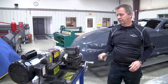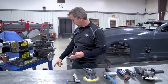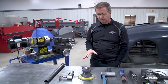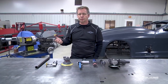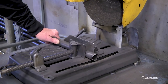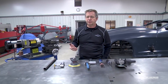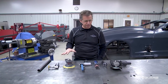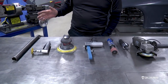There are lots of other ways to fit tubing also. This is a really nice machine with a nice little table where you put all the cutters on the bottom, but there are some other pieces you can use. To cut the tubing to length, you obviously use a chop saw — a 14-inch abrasive chop saw will cut the tube to length. But after you cut it to length, you're going to need to shape the fit, cut the end, or deburr it. These tools here are a small group of some of the things we use in the shop to do that.